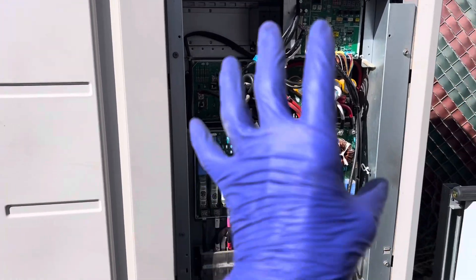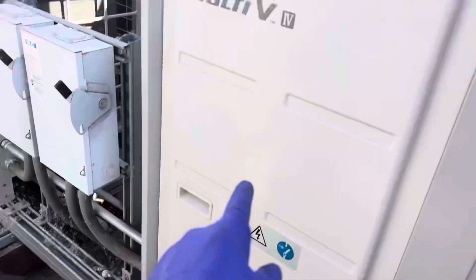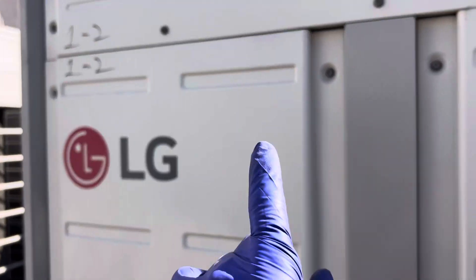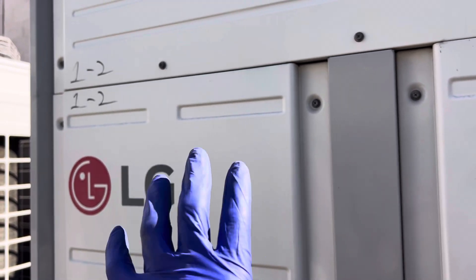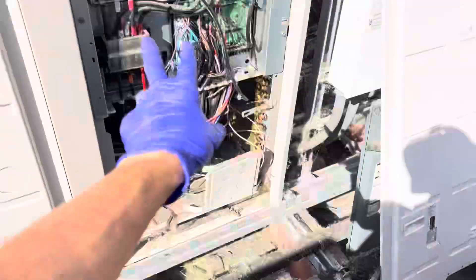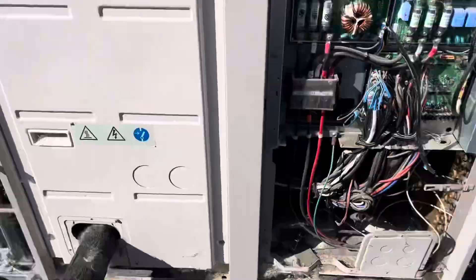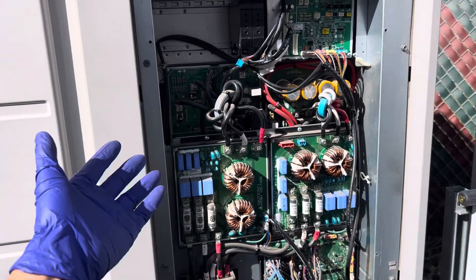Air conditioning that's a little bit bigger than a car — this one is a heat pump, and this one over here is heat recovery, so these ones do heating and cooling simultaneously. They share and swap energy from room to room; that's why they have three pipes coming out. These ones are set up as heat pumps only, so they only do heating or cooling — just like an electric car.